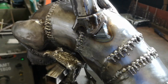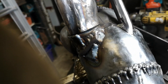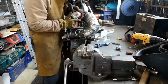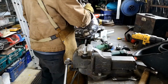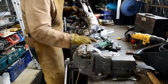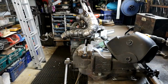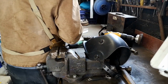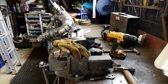Now, I spent a little bit of time taking some films of the way I do these wings. I want the wings to locate in one particular place so they won't turn in the wind and rattle around too much. I shall pin them as well. And I make a sort of drippy effect that drips both sides beyond the joint. So it really does lock a wing into place, which I found in the past works very, very well. And by the time it's been galvanized, which tightens up the joints a little bit, and I've put a pin in it, it isn't going to move.